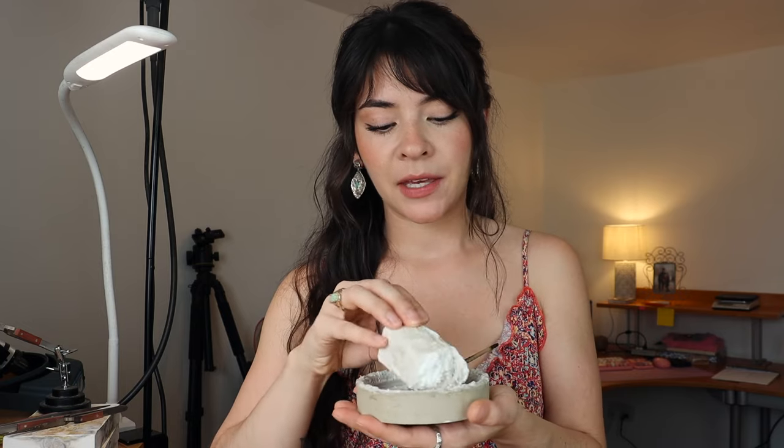Flux, and really anytime you heat something up, it's going to put off chemicals that are not good to breathe. So you want to make sure that you're soldering in a really well-ventilated area and wearing all of your proper gear. I know a lot of you who've been watching my studio vlogs are wagging your finger because I don't always wear my mask — I'm going to be better about that. Whenever we get to our new house, a good respirator mask is on my list to buy. Those fumes are really bad for your lungs.